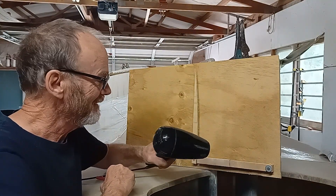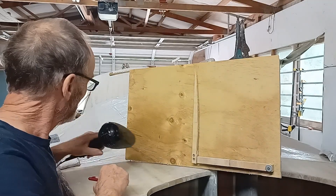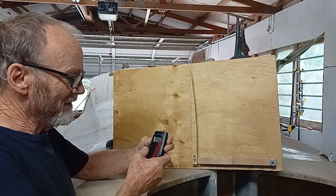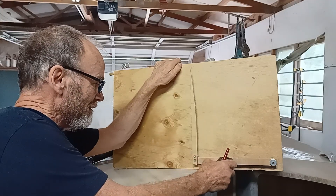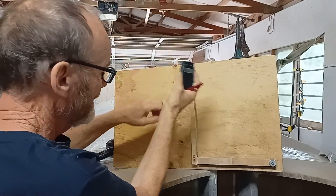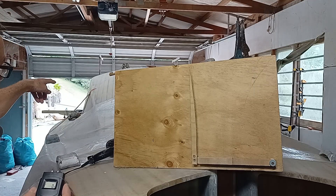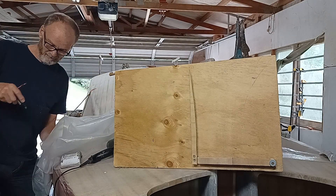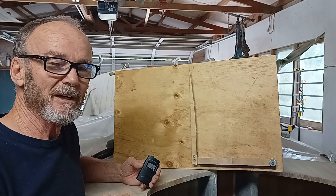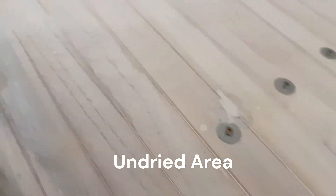It's already moved three millimetres up there. I'm going to do another little test now — here's my little moisture content tester in the gear, which I'll use to test it with. 9.5% maybe. It's still moving, so the moisture is radiating out. It'd be interesting to test the moisture on the boat between where I've been drying it and the undried areas. That's really interesting — where I've been drying the timber, I couldn't even get a reading. It popped up briefly at 5% and then wouldn't read again. So it really shows that the timber dries out pretty rapidly.